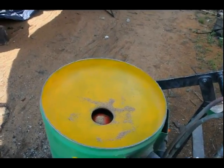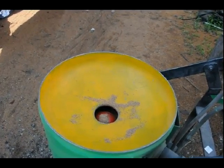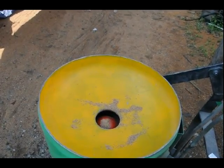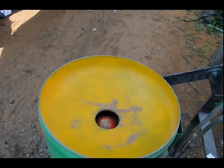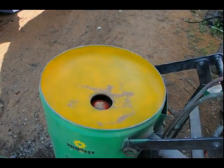Inside where the medium goes, there's a little ball valve in there. Take extra caution to keep fingers away from that ball valve. If the operator hits the trigger, that ball valve will come up with quite a bit of force and it will take off a finger or anything else that you stick in there. So stay clear of that hopper valve, and if you do have to clear anything, make sure that the compressor is not running. Very important.